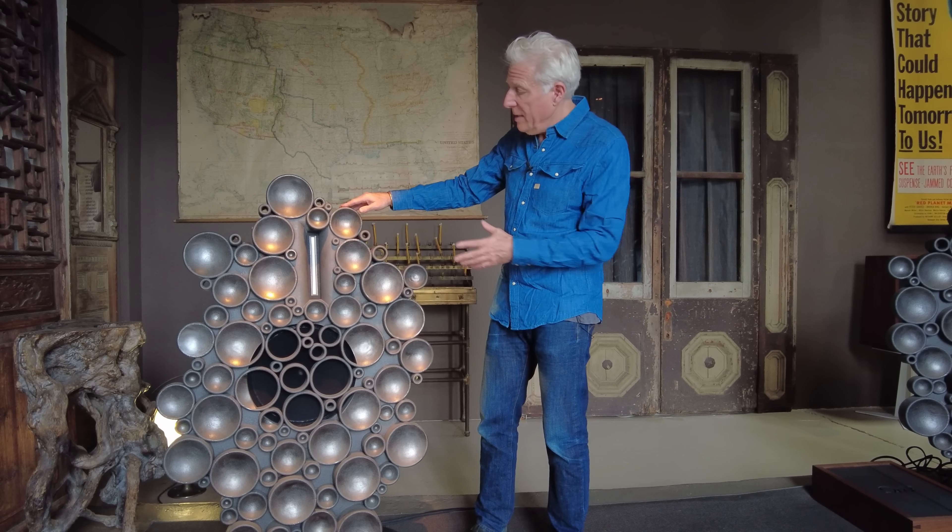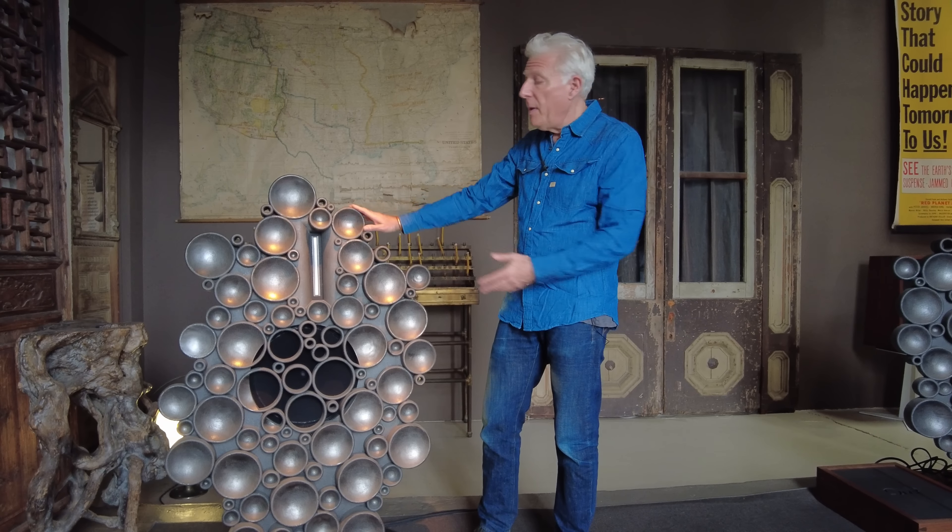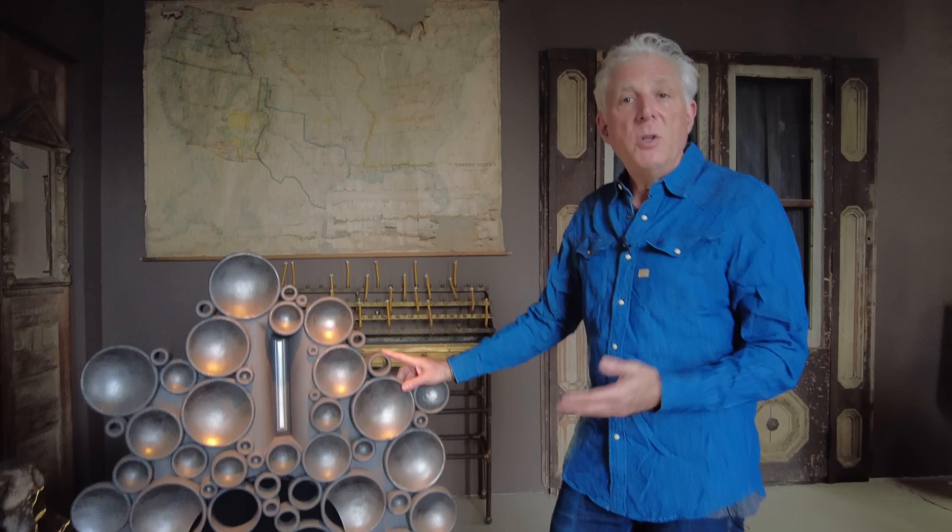This thing — people say it looks like a work of art. It was designed as a numerical, or actually quadratic, diffuser. What's that? Well, a numerical diffuser is a seemingly random organization of shapes and dimensions that will affect various frequencies and diffuse them in an even way. You see them in studios on walls and on the ceiling. In fact, we were just at Josh Benanti's mastering studio last night shooting, and the diffusers have all these seemingly random shapes made out of wood.